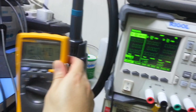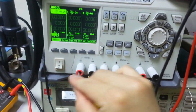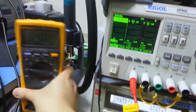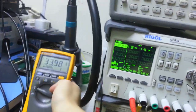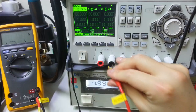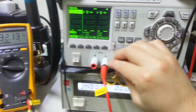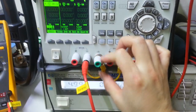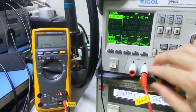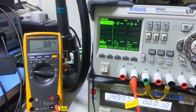I don't know why this Rigol DP800 series power supply creates such a large amount of AC coupling. I call it AC coupling to ground — possibly from a switch-mode chip or switch-mode power supply inside. To eliminate this 30-something millivolt coupling, you have to connect all channels to the ground reference.